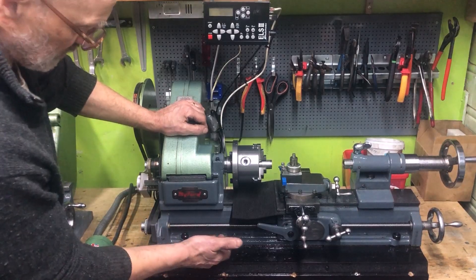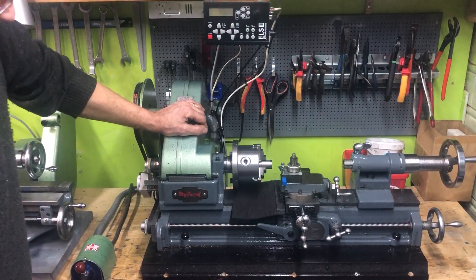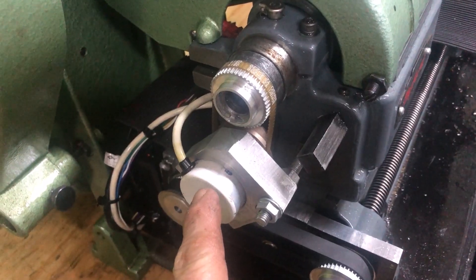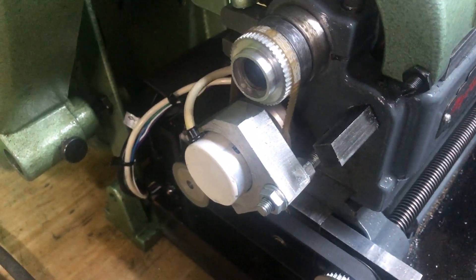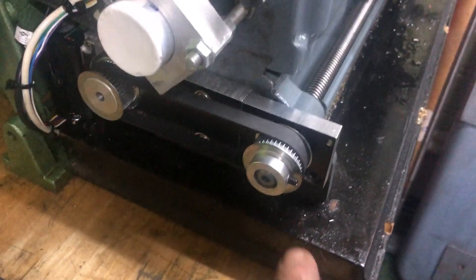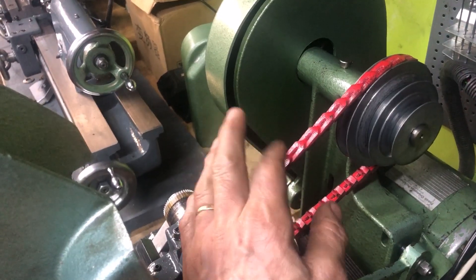I have also filled up the bed with epoxy granite, so it should be a little bit more sturdy and heavy. Bringing around here, you can see the encoder mounted to the spindle — rotating the spindle drives the encoder through a timing belt. And then I have the drive system, instead of gearing, with two equally sized pulleys mounted to a stepper motor, and the controller and stepper motor driver are up here. Otherwise it's just bog standard, apart from the link belt — I opted to go for the link belt instead of the normal belt.